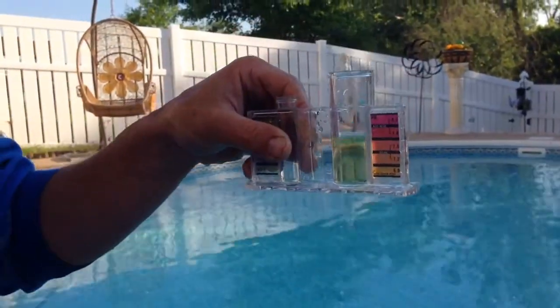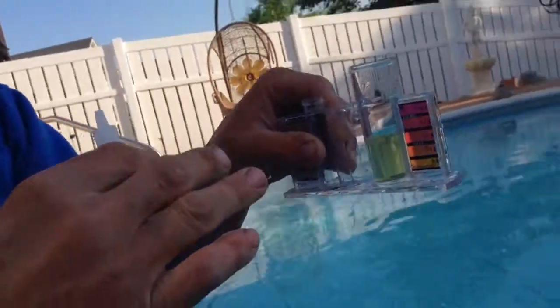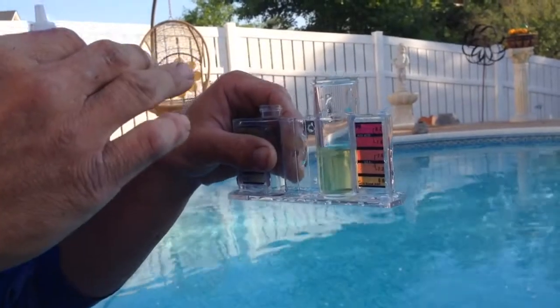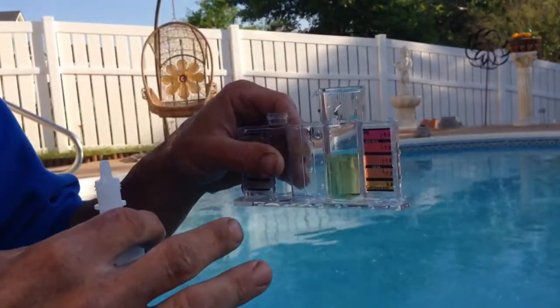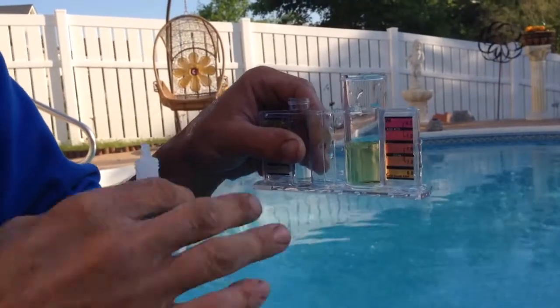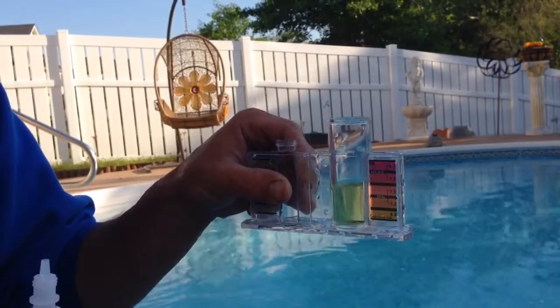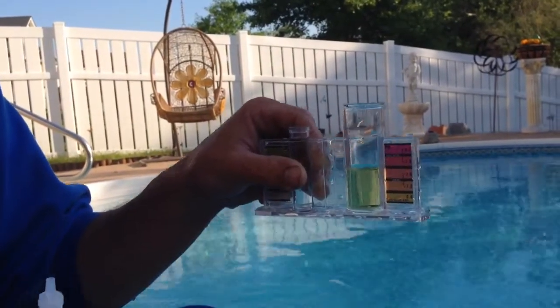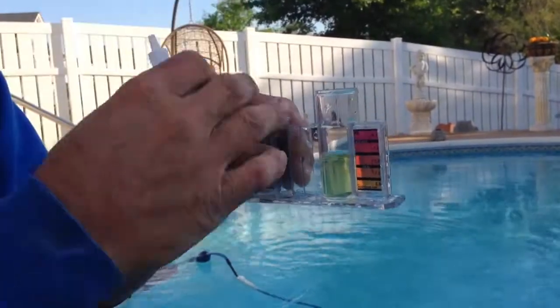You're at 9. Okay, so the alkalinity is low because you want to be between 12 and 17 drops. So if you're under 12, you're low. If you're above 17, you're high. So between 12 and 17. Correct. And how much did you drop? 9. So we are low. We are low, but pH is high.